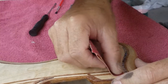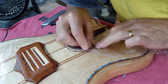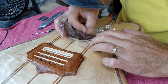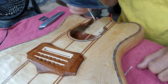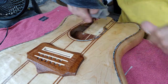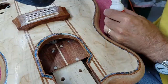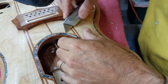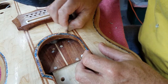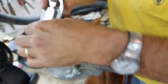Now if you look at the sound hole, I've added the veneer in a sandwich between two strips of mahogany inlay, whereas the outer edge that's just one stripe. But I want that mahogany-shell-mahogany sandwich look all over. So what I'm going to do now is use a similar method to add a mahogany veneer strip alongside the shell veneer.